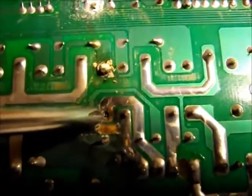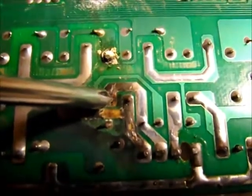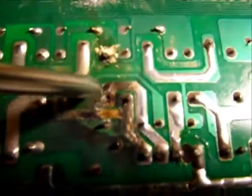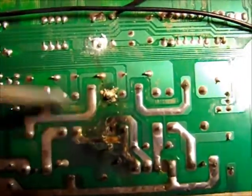The reason I think it happened: there's usually a soldered joint there — it's part of a relay. That's going to be the primary of the relay, and these are going to be the actual switched contacts. The pin has actually been corroded away, and what's happened is there's a lump of corrosion built up. With this soldered joint here, this is a 240-volt area. It's built up a hive of corrosion and it's just shorted out these two rails.